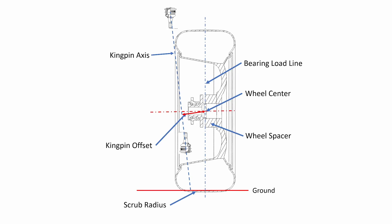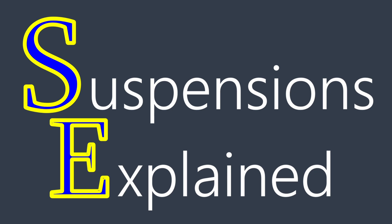Lastly, let's look at the bearing load line. You can see how the bearing load line, instead of going nicely between the ball bearing races, now sits well outside the bearing altogether. This means the bearing will have a large moment to resist — a moment it was not designed to handle. You could expect a much shorter bearing life and failures in a part that is normally designed to last the life of the car. Putting spacers on your car may look cool, but be aware of the effects they have on the handling and the durability of your car, and be prepared to replace parts that you normally would never have to. I hope you've enjoyed this video. Please hit that subscribe button and notifications, and we'll see you next time for more Suspensions Explained.